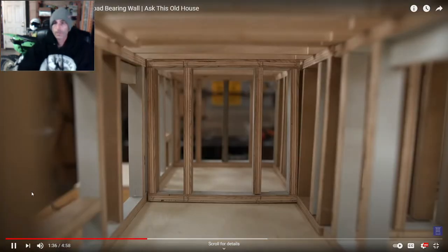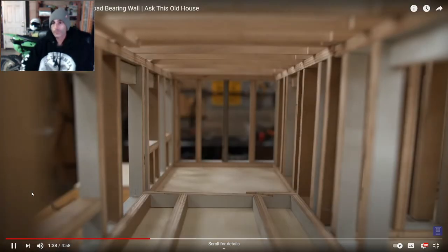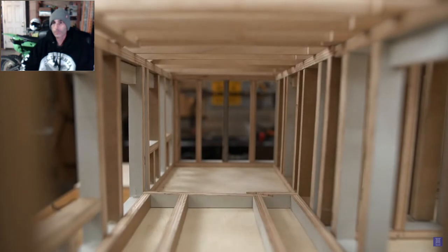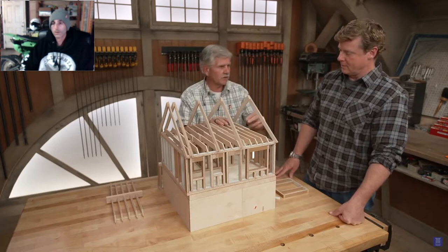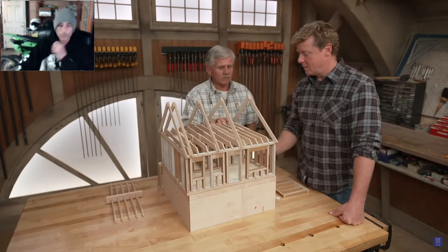All right, take that wall and move it away. If you notice, what's happened above? Nothing. Like all the load here is undisturbed. It can hold and support all of that. Right. Now this load-bearing wall right here that's over the beam in the basement that comes all the way up and carrying the second floor, what happens if we take that out?